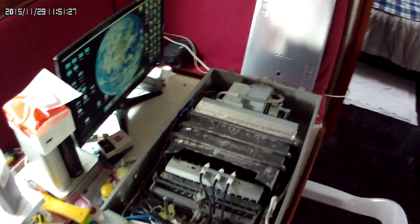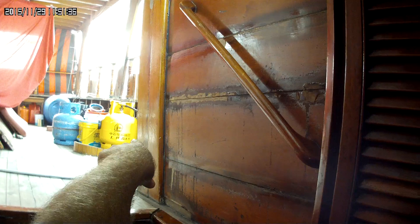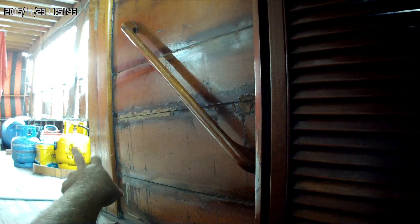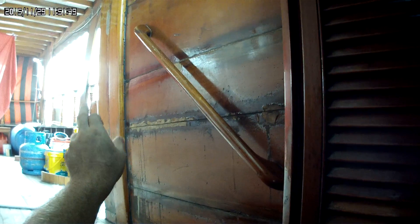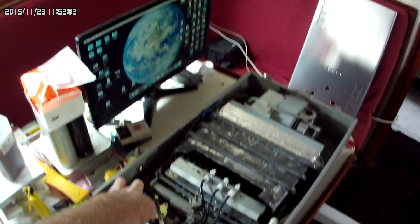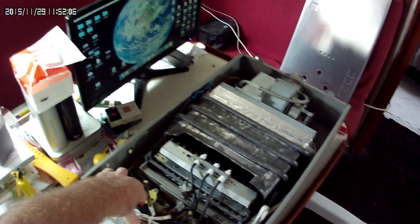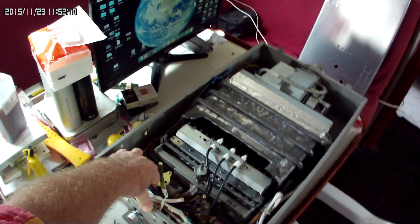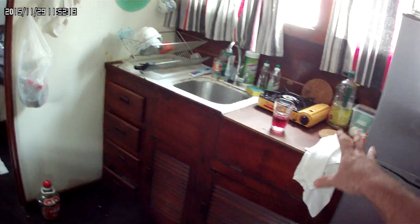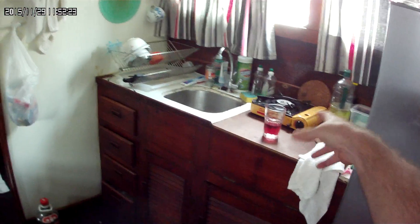The carbon monoxide is exhausted through the top. I'm using 13 kilo tanks — about 29 pound tanks — and the bar pressure out of that regulator: this unit is only going to consume one third maximum of the actual pressure that regulator allows, which means I have two thirds left. So I can actually run two devices — this water heater and a cooktop surface I'd like to put in the galley — right off the same regulator.